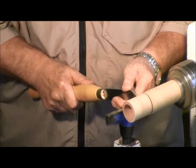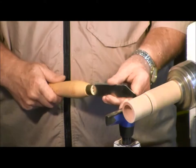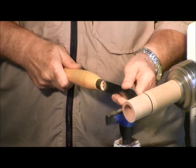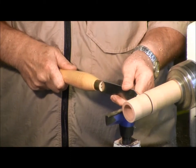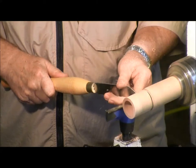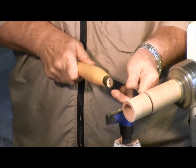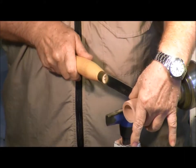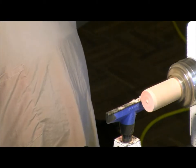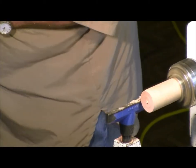I want to give myself about a quarter-inch bottom, so I'll part it right about there. When I part, I will usually make a hole that's wider than my part, because if you don't, you're going to start burning your tool up if you're going in pretty far. So I'll take it and part it on both sides until I get it the way I want it. With no sanding, I'm going to be able to set it down and get a nice sand on a flat surface. It looks just a little rough, but I'm going to do just a little bit of knock-off sanding — not really finish sanding — just to knock these edges down.